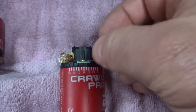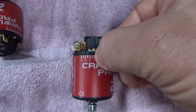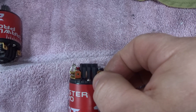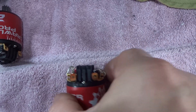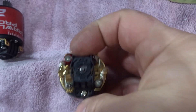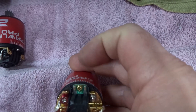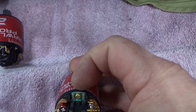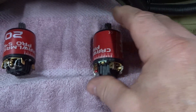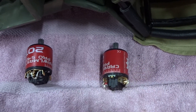If you don't have timing markings like these, what you can do before you disassemble — and it's very important that you do this — is get a scribe and scribe a line on your end bell and your motor housing, then rotate it and scribe a line on the end bell here and here. Undo the two screws, put this end up here and this end down there, and just line your scribe marks up. You'd actually have to do two scribe marks. Anyway, that's how you reverse the rotation on a motor — don't just flip-flop the leads.